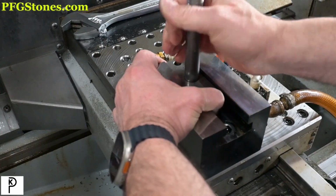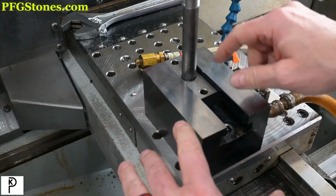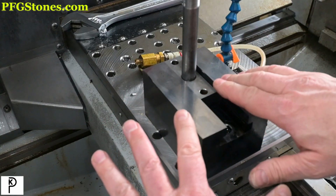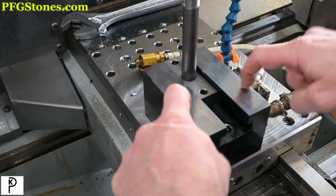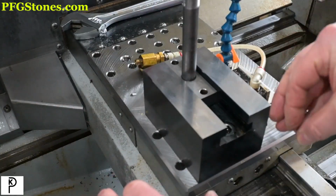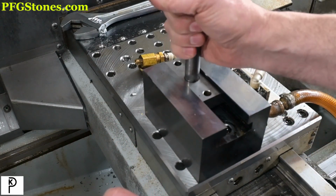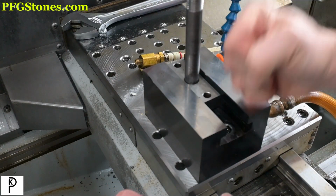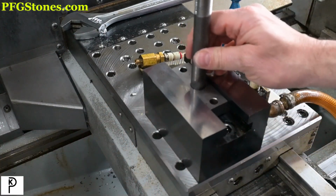So this is pretty good. Okay. This is not a perfect solution. The next step, if we don't think this is going to improve the tool post, is we're going to drill two tooling holes here on this block, and that is an even better solution, but it's a little bit less expedient. I mean, we'll be done 5 minutes after UPS shows up tomorrow, whereas if I have to pull the block out, then we're going to have to pull it out, drill it, ream it, and that's just going to take longer.